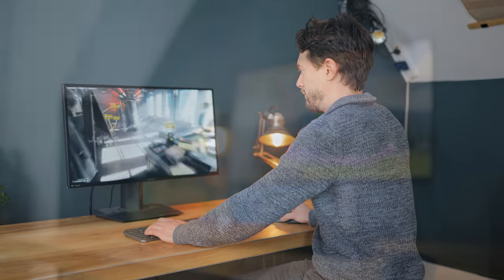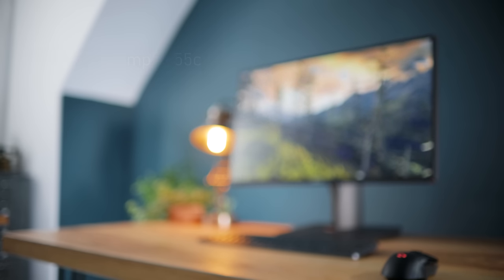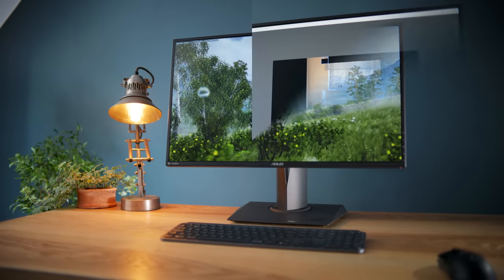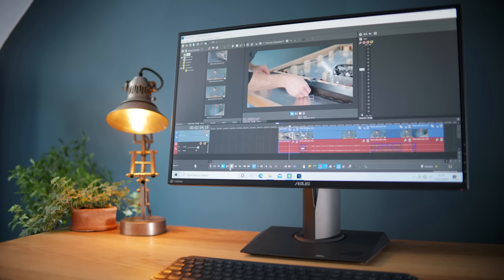In terms of numbers, the graphics card maxed out at roughly 55 degrees Celsius, which is why acoustic performance in games is so quiet. This is an excellent result, and means that the system would still be completely viable if coupled with an even higher tier graphics card like an RTX 3080. The only time the fans wanted to ramp up to audible levels was when I slammed the processor with an intense single core workload for longer than five minutes, which is really a limitation of heat transfer from the CPU to the water block rather than a limitation of the water loop itself. In general use for video editing and the like, the system remained basically inaudible — absolutely perfect.